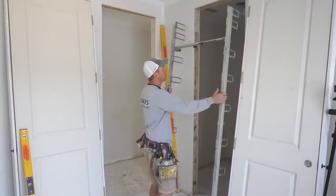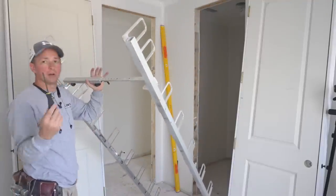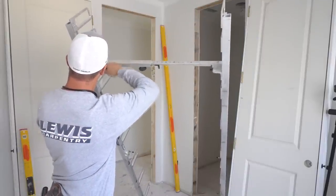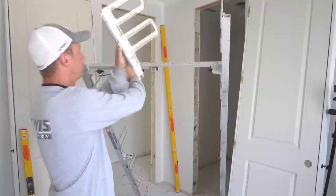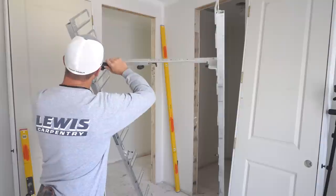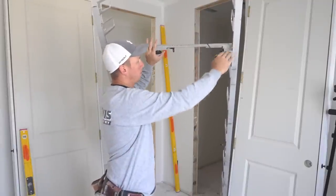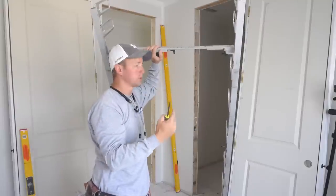Typically I'm hanging six-foot-eight doors with the Jam Master and that's usually how I have it set up, but you can also set up the Jam Master for eight-foot doors and it's very simple. There's an extension right here on top and I'm just going to loosen these two screws — this extension pops right out. So if you want to use the Jam Master for eight-foot doors, you're just going to add those two extensions on both sides, tighten up the screws and you're good to go. I run my spreader bar basically pushed all the way up against the extensions and that works pretty well.